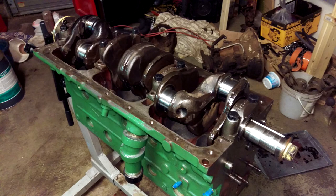We've been wanting to get a video out to you on the backhoe engine for some time. We've had an ongoing saga with this Continental F-244 engine, and I thought we'd do an update because I'm sure some of you are curious about what's going on. As we began to put the engine back together, I could not get the crank to turn — it was just too tight. I couldn't figure out why, because there seemed to be enough clearance using plastic gauge and things like that to check with the new bearings, but I just could not get the crank to turn except by using a long breaker bar with a lot of power. That's not good — that's not what you want.